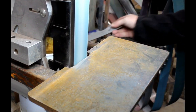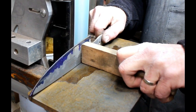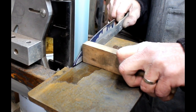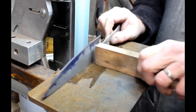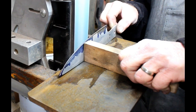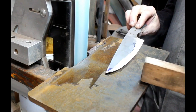After I break that 90 degree edge, I'm going to start to use that push stick. The upper end of the push stick is where the pressure is being applied. I'm not really pushing in on the stick — I'm holding the stick in position, and then as I'm pulling the knife from left to right, I'm pushing back with my thumb on my right hand. So I'm levering it against that push stick so the tip of the knife is not going to dig in on the leading edge of the belt. All I'm doing here is removing material.